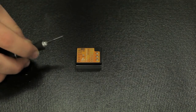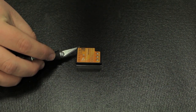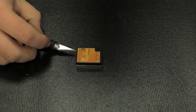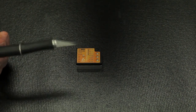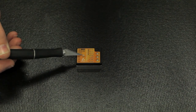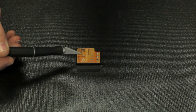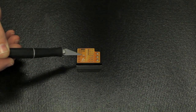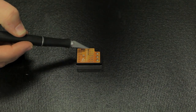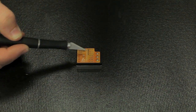Here we'll cover some of the features of the unit itself. Basically this is where all your channel assignments are and you use your receiver adapter cables to plug these in. Right here is where you can update the unit via the USB interface. There is also a status LED that will glow different colors based on different commands, settings, different tail servo types, and pulse widths. Each color of the multi-color LED will indicate one setting or another, and you have your rows of LEDs labeled A, B, C, D, etc., each corresponding with a specific setting.